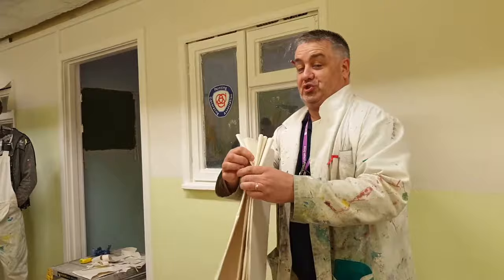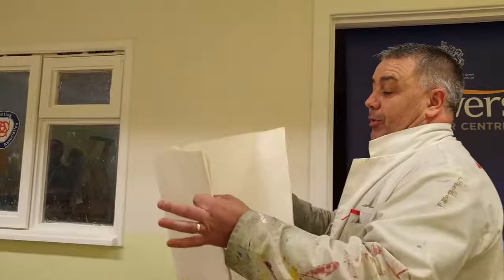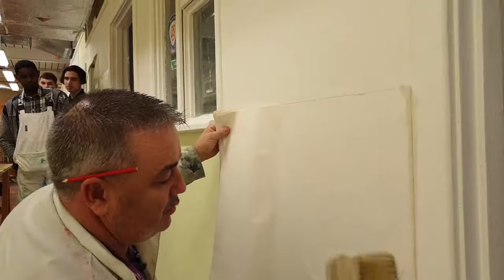Hopefully Harrison has put the paper on straight. So we get this hanging brush and we keep our scissors in our pockets. Also have the pencil and we open up one fold at a time. Same procedures again gents and ladies — left hand as it is, put it into place. Then you get your hanging brush out and you brush it into place.